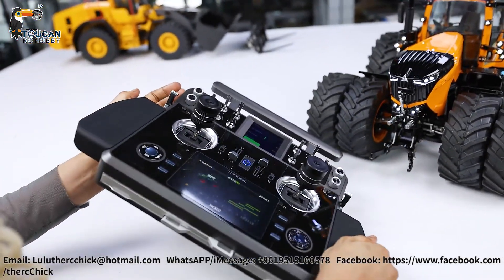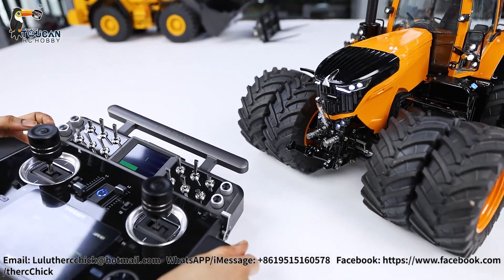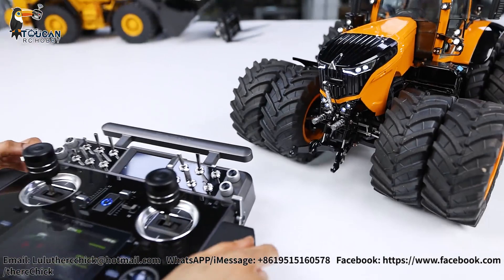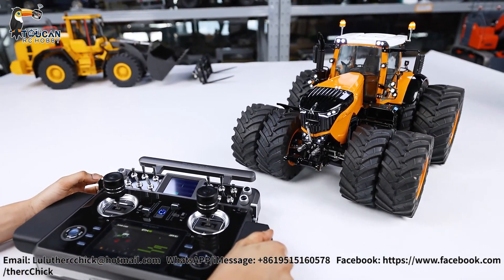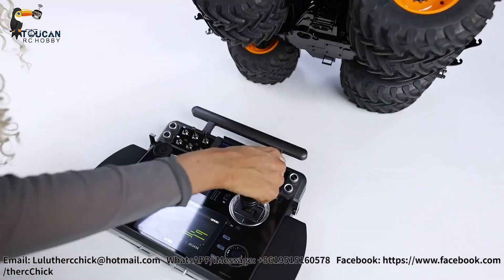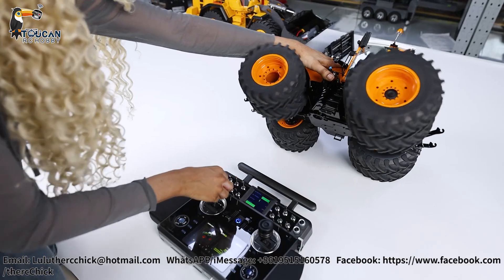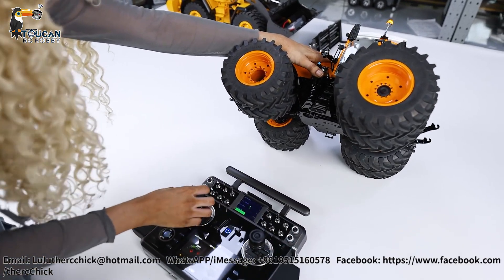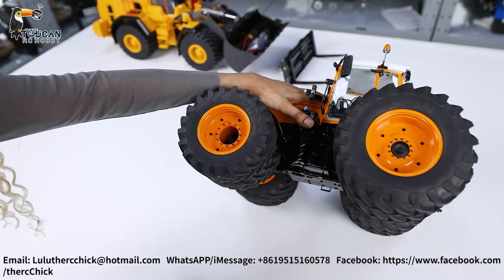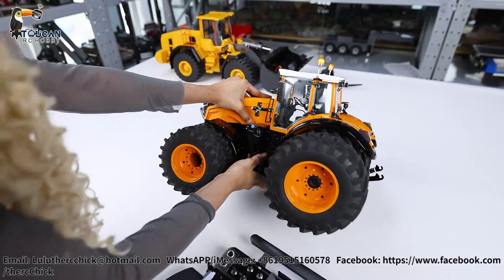This switch on the side is for the hydraulic parts in the front. We also have extra hydraulic lines in the front that will have their own switch for when you get all your attachments — you can set it up on whichever channel you want. Finally, the differential is the ninth joystick. When it's in the center it's unlocked, and when you flip it down or up it's locked. When going through really muddy terrain on a farm you will definitely need this.